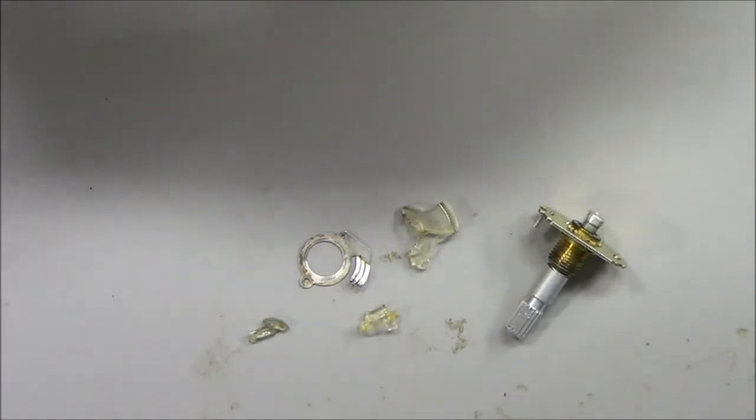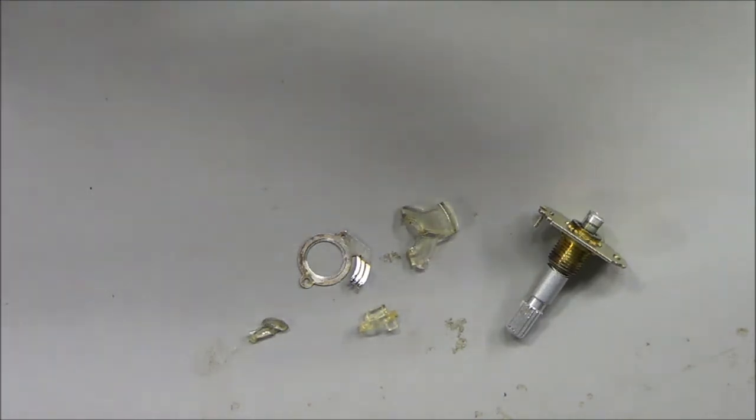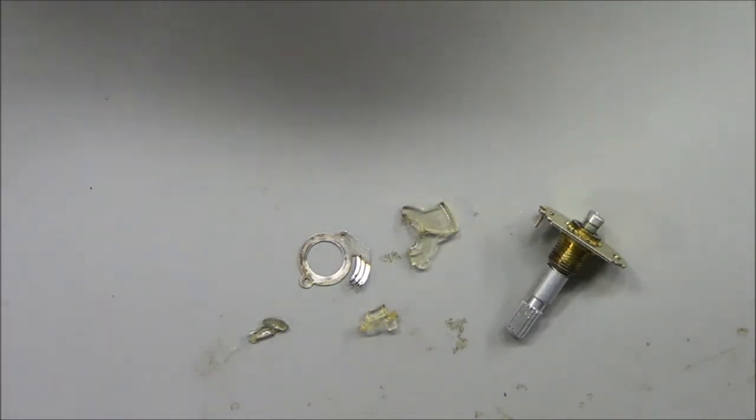It didn't print right the first time around, and I understand why. When I showed you all my settings for using the slicer, this is the first time I used the slicer software on the computer I'm using now. Normally I use another computer to do all my 3D slicing, that's where all my programs are. So I had the wrong settings for exposure time for each layer. I used the default value of 2.5 seconds. It actually should be closer to 8 to 10 seconds per layer.